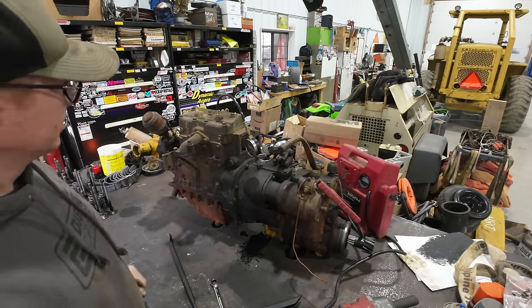The opposite side here, I haven't separated out yet. Actually, the other side here is a one-piece bearing, so to remove it, we would have to pull the crankshaft assembly, undo this castle nut and that gear, and then that bearing would slide off of there. I don't know that we're going to get that carried away, but man, she's in bad shape.